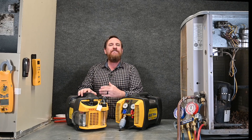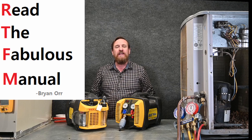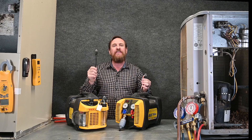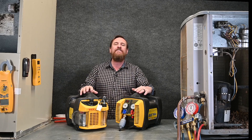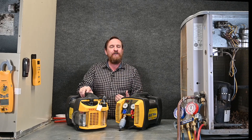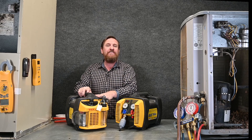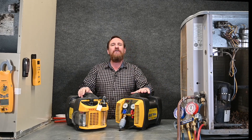This equipment is very expensive and you need to understand how to work it. Regardless of which equipment you're working with — RTFM, read the fabulous manual. There's tons of information in there, such as the cord size you need to use, the maximum length, the thickness of the cord, what type of oil to use, and how to service the machine. Very valuable information. The vacuum pump works great at dehydration, pulling to a low vacuum, but if you hook it up to pressure in the system, it would blow out the vacuum pump and severely damage it. If you tried using a recovery machine to pull a vacuum, you'd never get low enough to truly dehydrate the system. So they each have their own individual jobs.